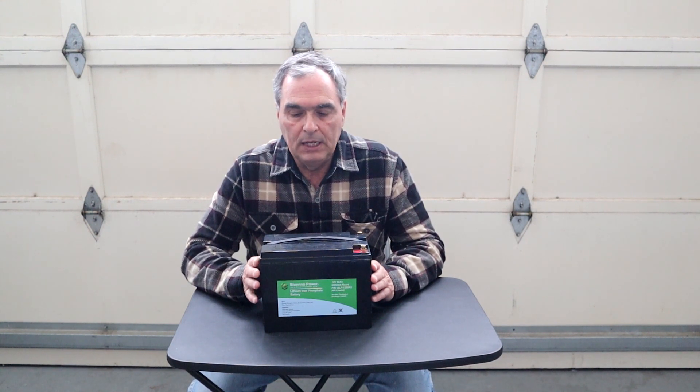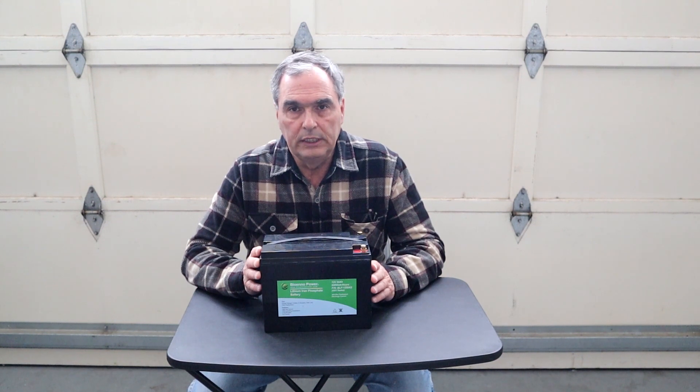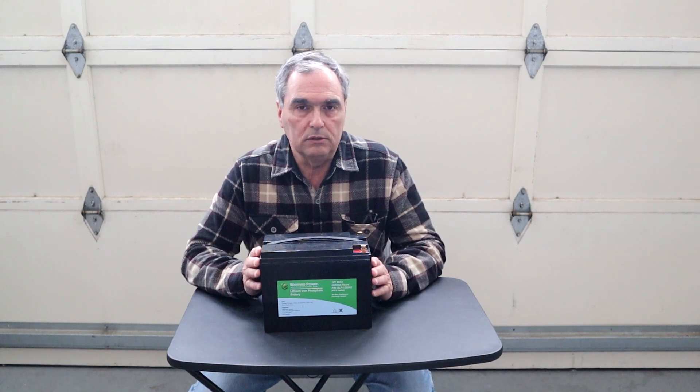To summarize the results: this battery provided 47.6 amp hours, or 606 watt hours, which is right at 95% of its rated capacity — pretty good compared to other batteries on the market. It maintained a voltage of over 12 volts for 96% of its actual capacity. With a 10-amp lithium AC charger, recharging from 0% to 100% took a little under 5 hours, and with a 100-watt solar panel it took 8 hours. In the field test at 30 watts, I was able to run for 20 hours; at 60 watts you could scale that to about 10 hours, with the option to partially recharge during the day.